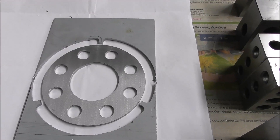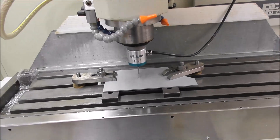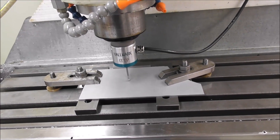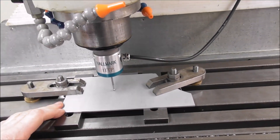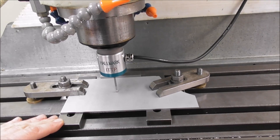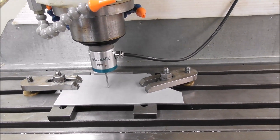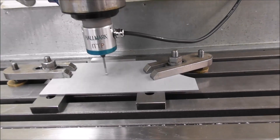You may have, say, three tabs holding the work in place while you do the majority of the machining. Work holding your material if it's thin, like sheet metal, poses some interesting challenges. I could machine opposite edges and hold this in a device, but this is a little bit quicker because it's just a piece of rough stock, so I'm clamping it down on some parallels. If it's any thinner than about two millimeters with that sort of span, rather than using parallels you'd be better to clamp it down onto a piece of half-inch plywood or something like that, because depending on the span between the parallels, if there's too big a span, the cutter pressure will cause the sheet metal to flex down away from the cutter.